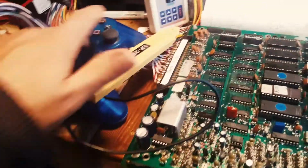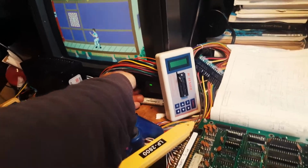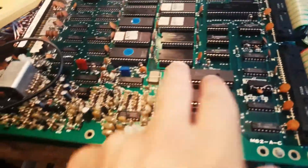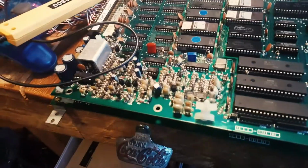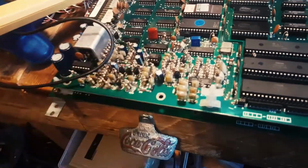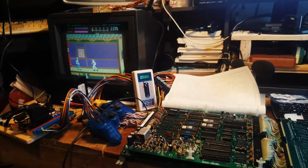But anyway, let's have a look. Oh, well, there you go. Perfect. So this was just a case of this bad chip here, this bad CPU that deals with all the sound circuits, the audio circuit. It interfaces between the audio chips here and the ROMs and RAM. That's really good to know. At least those guys are working then, and the new op amp is working as well. So there you go, and this is another Kung Fu Master rescued from the dead.